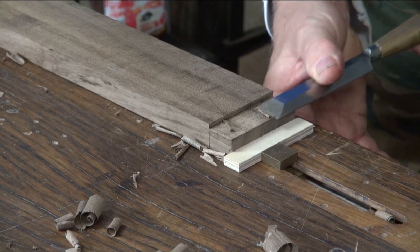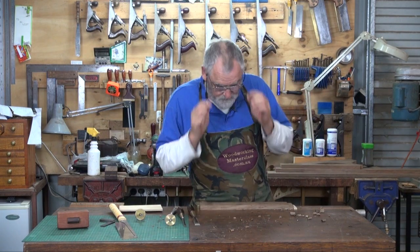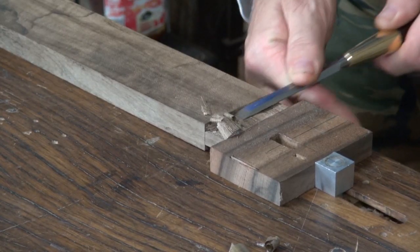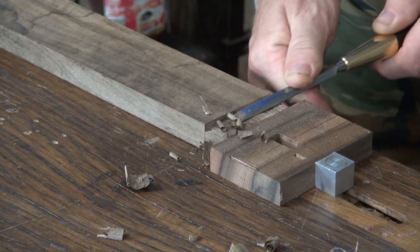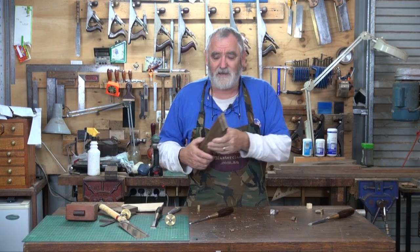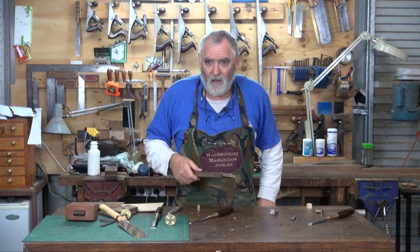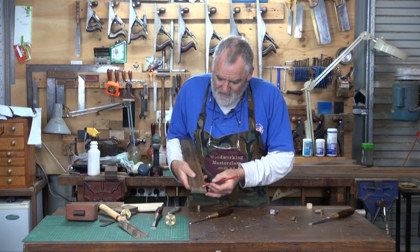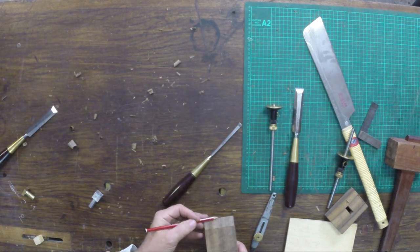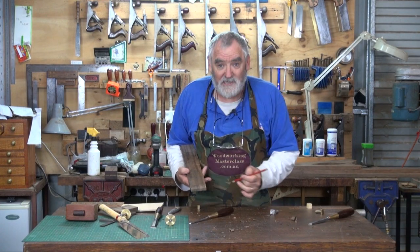And that's pretty close to the line. I'm not going to go down right onto the line — there's a little bit of fat there, so I can do some trimming when I've actually done the mortises. And there you have it, a finished tenon. I've just got enough meat on there to play around with to fit it into the mortises. But what I'm doing is different to a normal tenon — I want to have what they call a twin tenon. So that means there's going to be a bit of meat taken off here and a bit taken out of the centre. In effect, it's like a square dovetail when you look at the process we employ to do it.